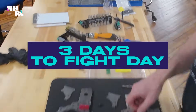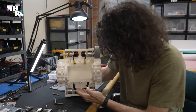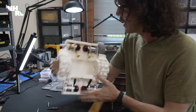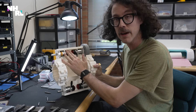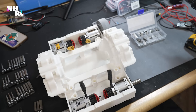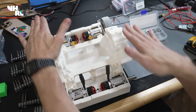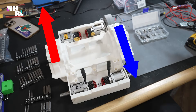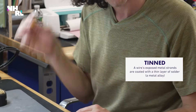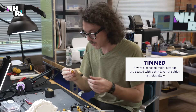I ended the day running eight printers again. It runs four-motor, four-wheel drive and the left side is tied together - so when the back left goes forward, the front left also goes forward, and the same is true on the mirrored side. When the front right goes, so does the back right. That allows us to have tank steering - when the left side goes forward and the right side goes back, the whole thing spins in place. Now it's time to solder. The connectors are tinned, the wires are tinned, and I'm just going to bring it all together.